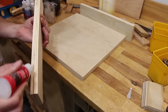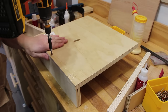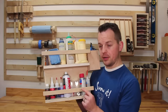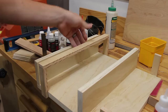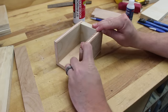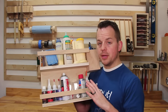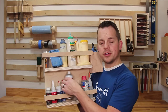This rack has two shelves and a guard rail around the front. I wanted to see how well CA glue would perform gluing together something non-structural but still solid — so these rails were just glued in place. There are a couple pin nails in the back to hold them to the sides, but otherwise it's just CA glue holding it up. I also added a little box for my glue brushes attached to the side of the shelf. For small stuff where you're not holding a ton of weight, CA glue works really well. This rack has no locking feature because there's so much weight on it and the stuff I'm pulling out is small, so I'm not concerned about it getting knocked off.